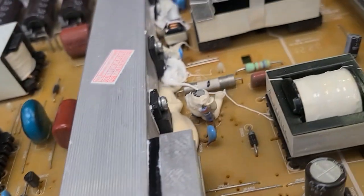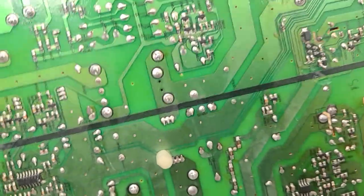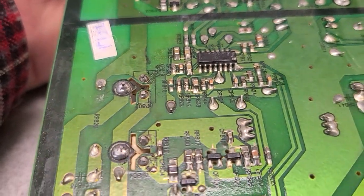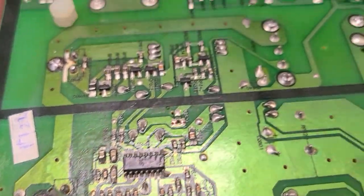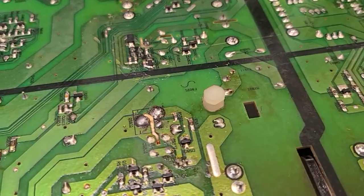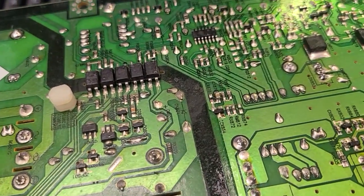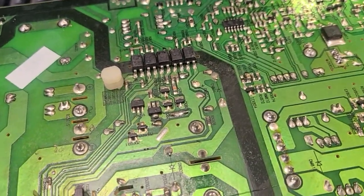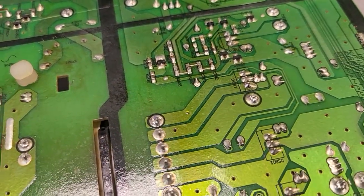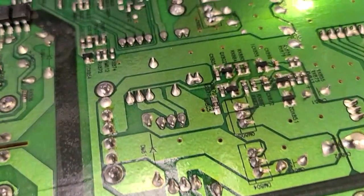The second thing I noticed is that little black dust at the back of the capacitor near the bottom — that means this component probably smoked and was replaced. On the back you can see flux around the soldering. I don't trust what they substituted for the thermistor, especially given all the other signs on this board. Another way to tell a board comes from China: it'll be dirty on the back — they store them poorly, in open conditions with humidity. Some are really terrible. This small crack is nothing to be particularly worried about; that happens with shipping in America too.